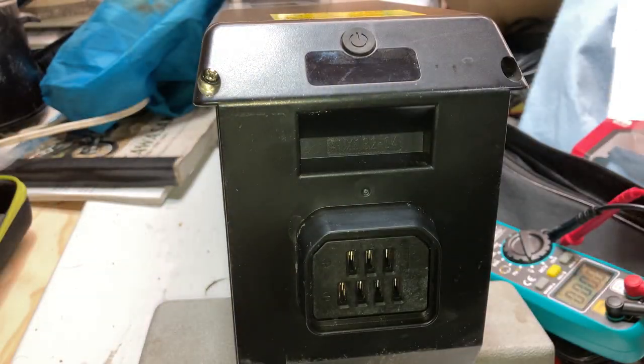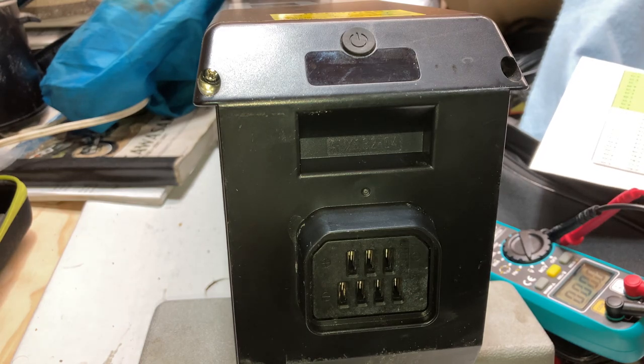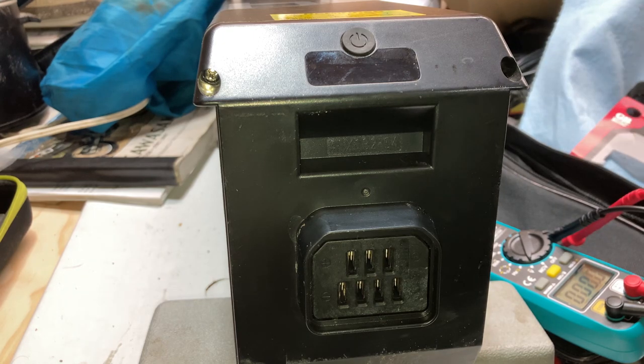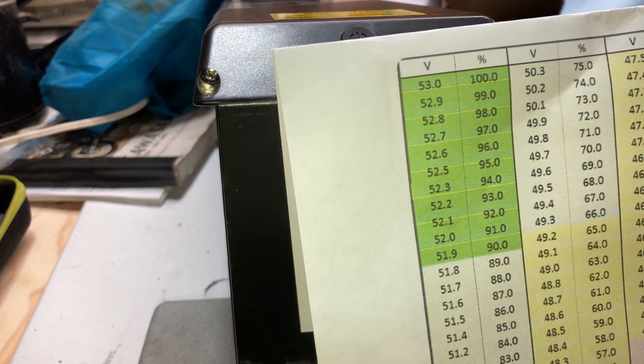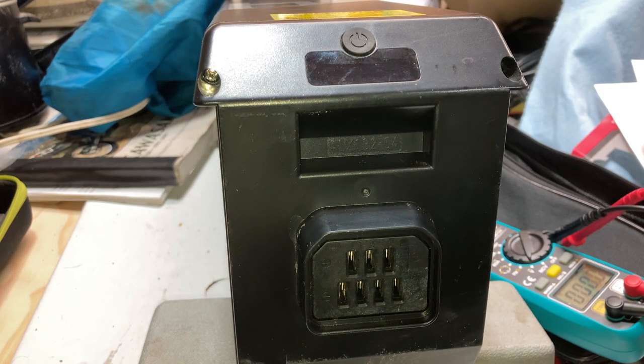Now that chart only works for a 48 volt battery. I know people say this is a 48 volt battery but the chart shows 53 volts — well, chargers usually run the battery up to about 54.2 to 54.6 volts, and once you unplug it, it steadily drops down to about 53 by itself. So it is a 48 volt battery, it just shows 53 volts on the multimeter.